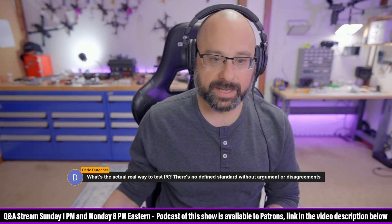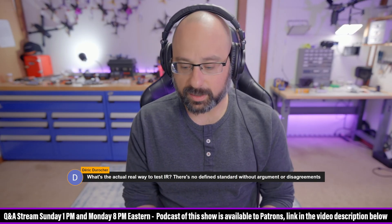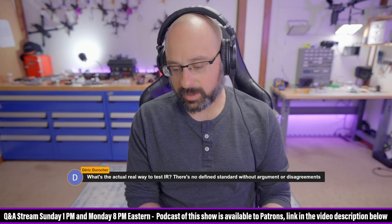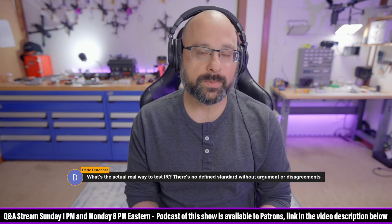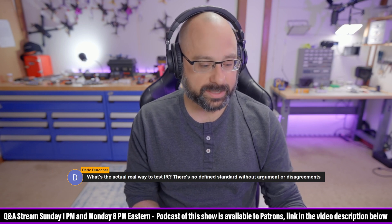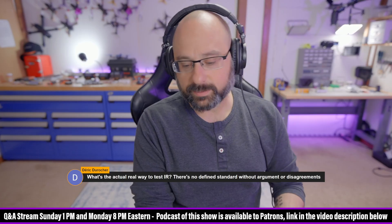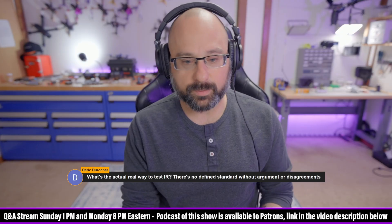The DC one is more common, cheaper, and easier to use. Basically, the way it works is you draw a current from the battery and measure the voltage drop when you draw the current, then calculate the internal resistance. The problem is you have to measure the current flow very precisely. Accurately calibrating current sensors is difficult in a mass production situation, and a lot of times the cheap tools we use aren't well calibrated — that's why they give super different answers.